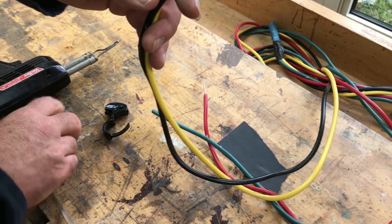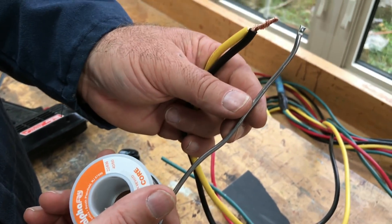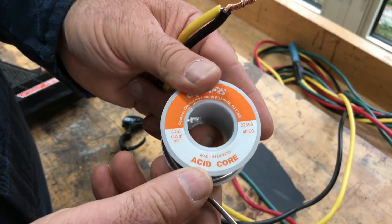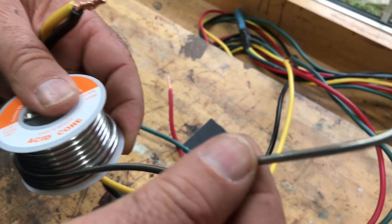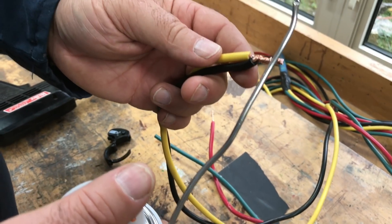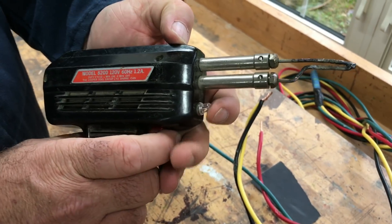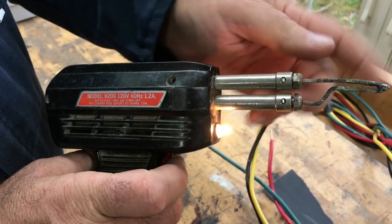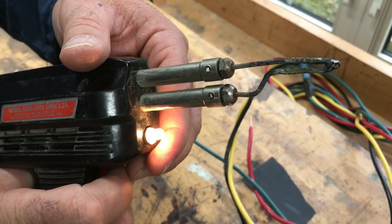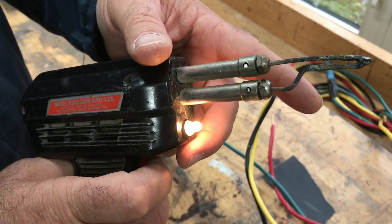To make the solder connection I'm going to need some solder. Solder for this purpose is a combination of lead and tin, and this is what they call acid core solder. In the middle of it there's a little bit of acid which helps to clean the metal for a nice solder joint. This is a soldering gun — you pull the trigger and in a few seconds the tip heats up hot enough to melt the solder and to heat the wire so the solder melts and flows into the pores.